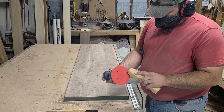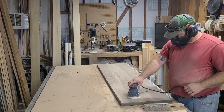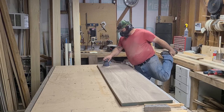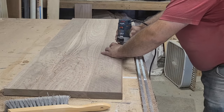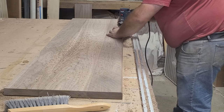Then, like a child, I drew all over the top before beginning the monotonous activity of sanding — but I won't bore you with that, although I did get in a little sanding yoga. Before finishing the sanding, I needed to add a profile to the front edge, and for that I used a 45-degree chamfer bit in my handheld router. Once that was done, the top was ready for its finish coat.